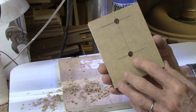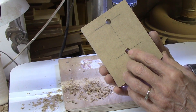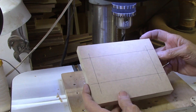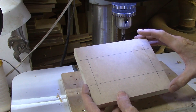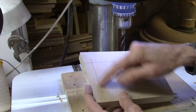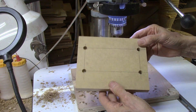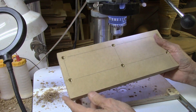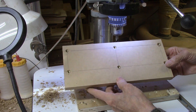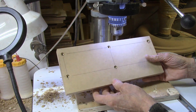There's my plate ready to screw in the two inserts. I'm using inserts with an inside diameter for number 10-32 screws. This is a slightly larger board — seven inches long by six inches high — for larger segmented rings or even solid boards. It spans two sets of mounting holes on the AccuSlice carriage, so I'll drill four holes before putting the inserts in. Here's another board I made previously with six inserts; it spans the entire width of the carriage and is all ready to mount.